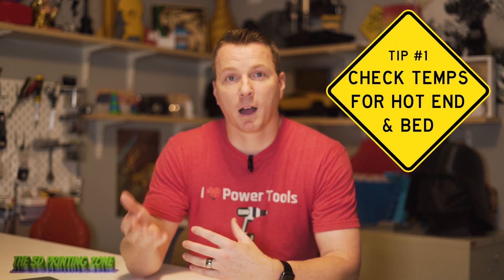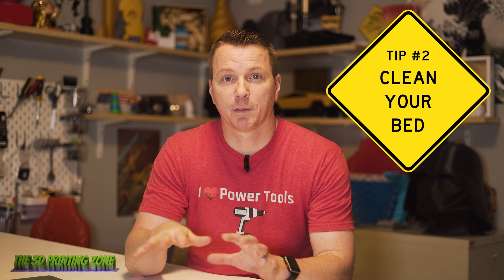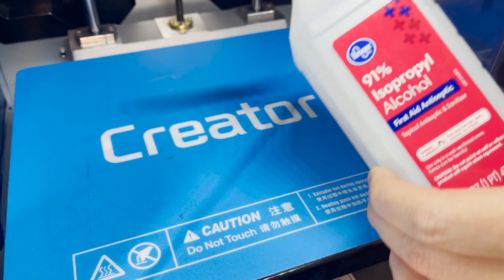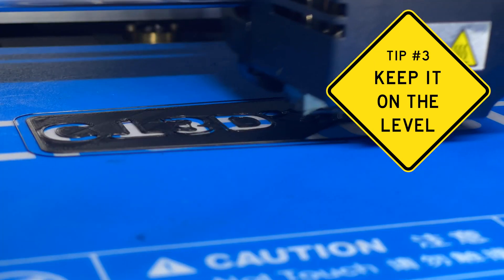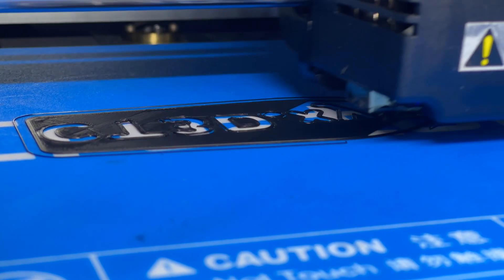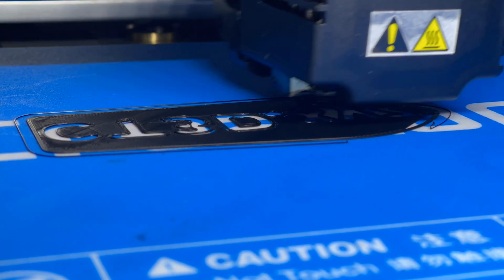A question I'm commonly asked is: what do you do if it just won't stick at all? There's a troubleshooting guide I'm going to leave a link to in the description that you should check out — I actually refer to it myself pretty regularly, even after years of 3D printing. Usually it comes down to a few things. Number one: make sure you're using the appropriate temperature for the hot end for your filament, as well as for the bed. Number two: make sure the bed is totally clean and free of grease from your fingers or any other debris — use some alcohol wipes or isopropyl alcohol to wipe it down. Number three: make sure you've got the right distance between your hot end and your bed, just like we've been talking about. If those still aren't doing the job, check out that link in the description.